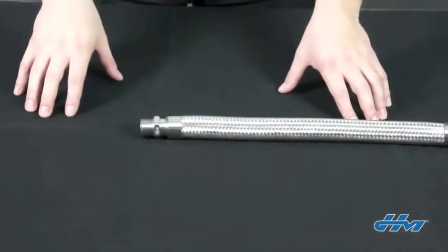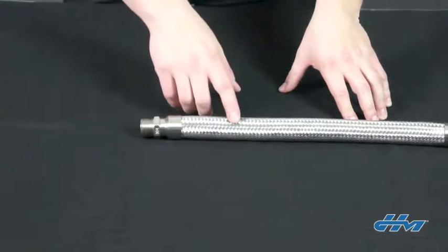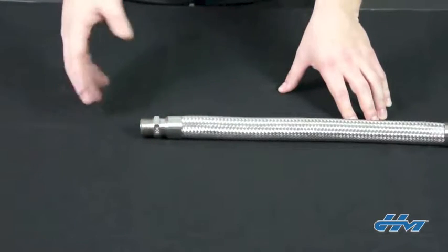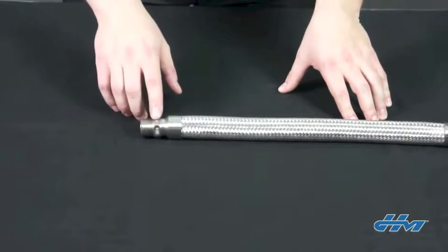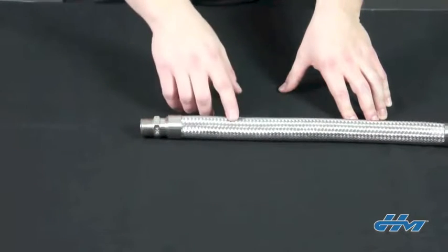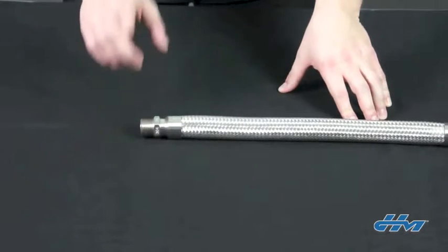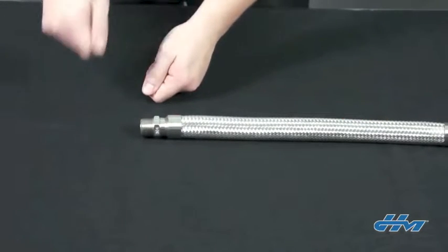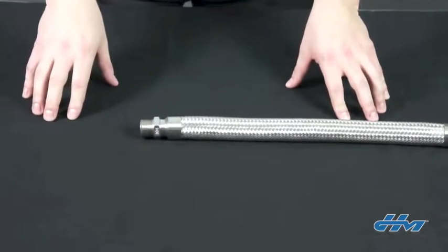When installing a hose, significant physical damage can be done to the fitting, the welds, and the braid with the various tools that may be used to install it. Don't use a wrench or other tools on the hose anywhere but on a hex pad. Gripping the hose by the braid collar, or the threads will damage the assembly. Do use a second wrench or a swivel-capable fitting when applicable to prevent twisting during the assembly installation.